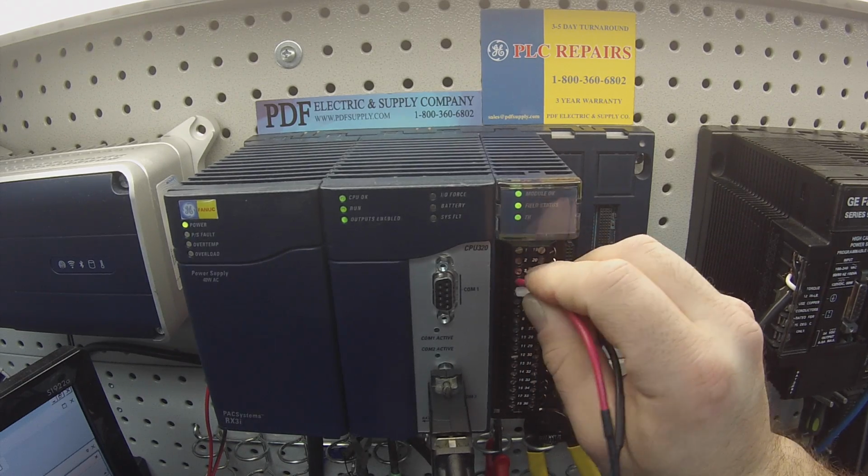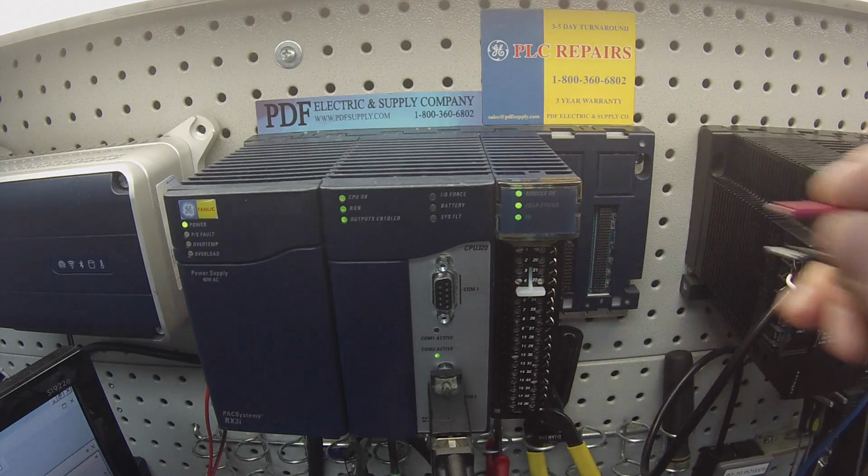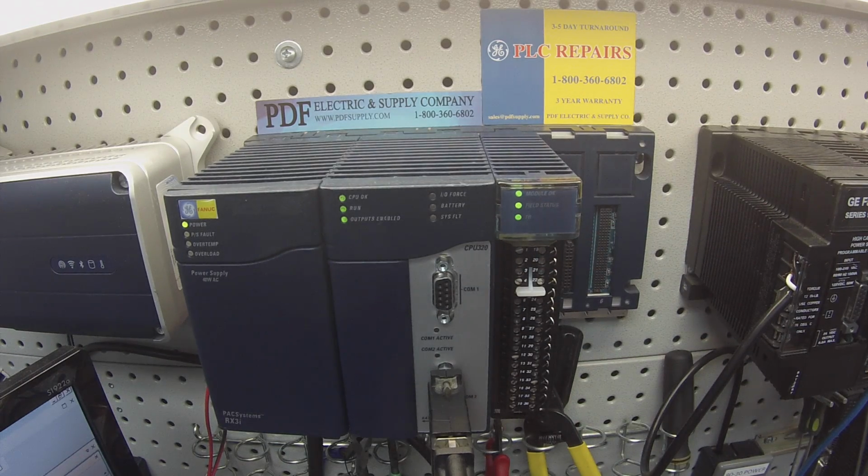The other thing, and I see this very commonly, especially with analog input cards, is you may probe it with 3 volts, and it'll be telling you that you're giving it 10 volts. What that means is the circuit will fail at full value. No matter how much power you put on it, as soon as you probe it with something, it's going to tell you that you have 10 volts there. It could be 1 volt, it'll tell you 10 volts. It could be 3 volts, it could tell you 10 volts. That's another problem, and that's definitely a failed card. So any of the 3.